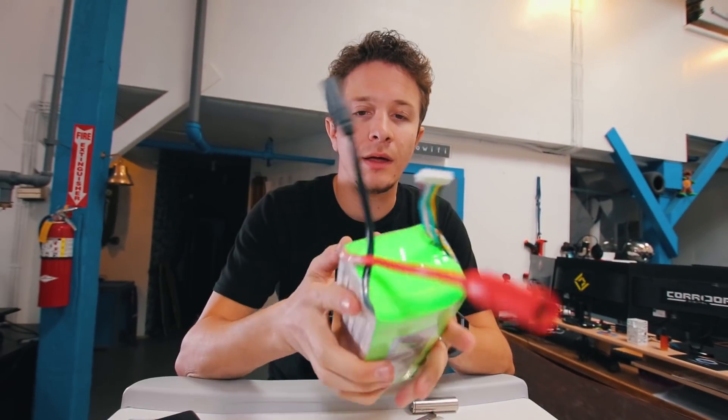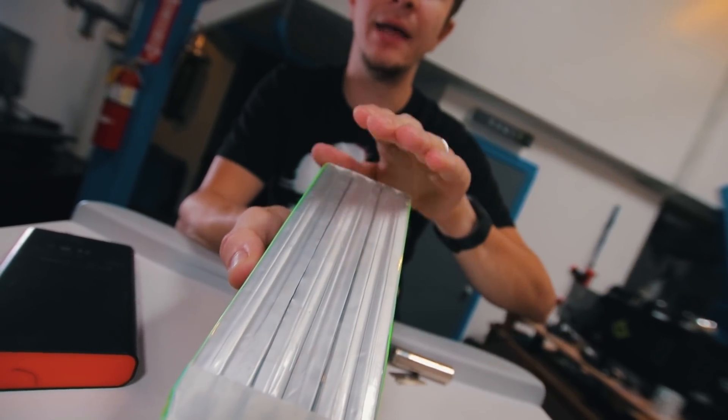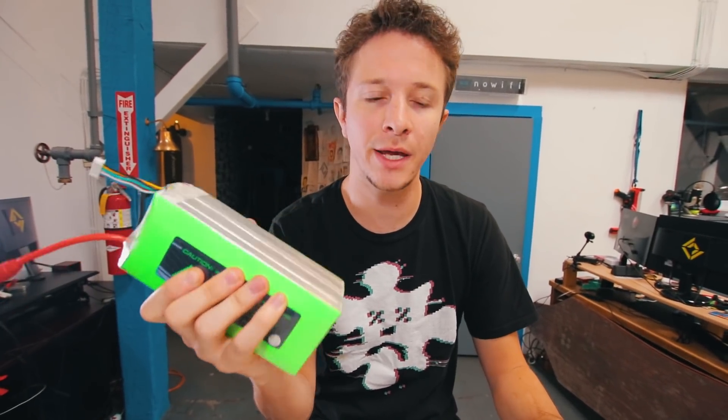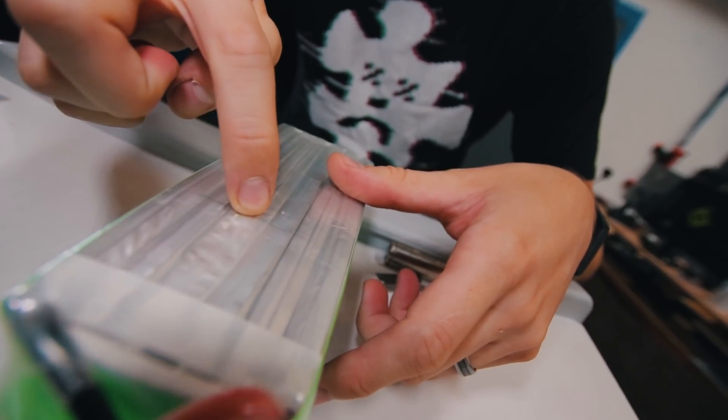This one is broken — one of these cells. Six cells in this bag, and this cell right here is busted. They produce gases; when they're not treated very well, they can expand in their own container. That's why you get old LiPo batteries and they're puffy. This battery is mostly fine, however this dead cell is preventing the rest of the cells from functioning normally.